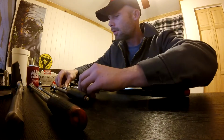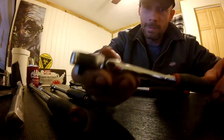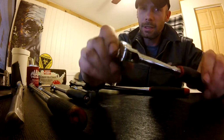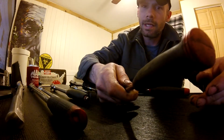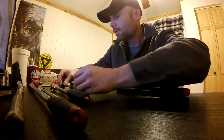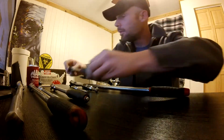So from that, my most favorite 1/4-inch ratchet. This is also a dual 80 Snap-on. This is an 8-inch ratchet, 8 1/4 inch, I believe. It is also the non-locking flex head, 72 tooth, with the comfort handle. This is basically the same as my 3/8 ratchet. It's just 1/4 inch and shorter. Probably this is my most favorite ratchet I've ever used that I can think of.